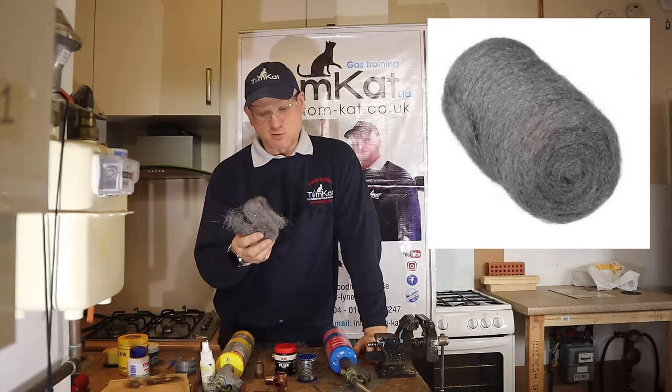I need another piece of pipe. When you're soldering, you should always fill every hole — a fitting without a pipe inside it will oxidize as soon as you put heat on it. We're cutting using pipe slices. I've slid the pipe slicer on, and I twist it in the direction of the cutter — there's a directional arrow on there. Twisting the opposite way makes it come off.